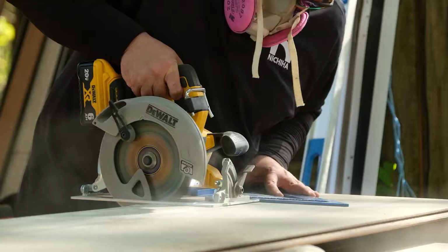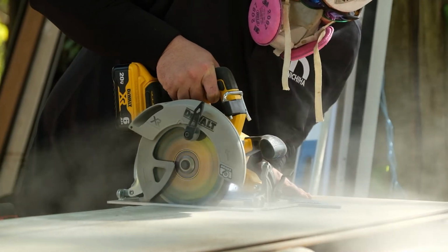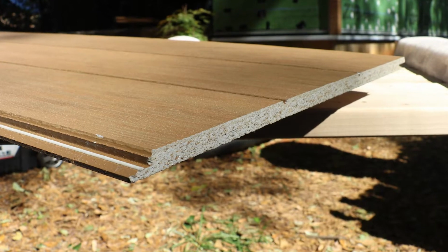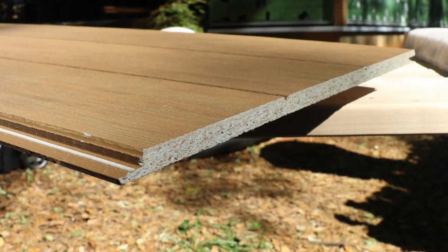Once you've reached 30 feet with your first course on your wall, cut the shiplap off the right side of the panel so you have a smooth, flat finish. This will allow the panel to meet flush against the double flange correctly.